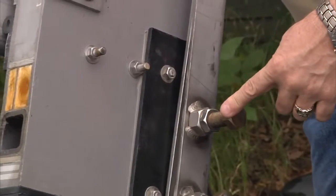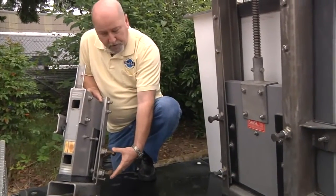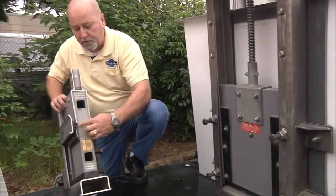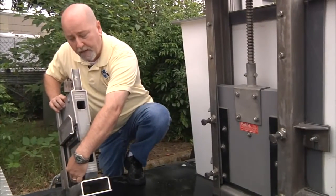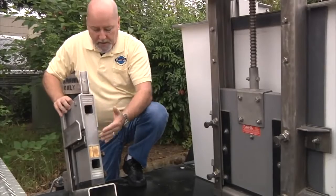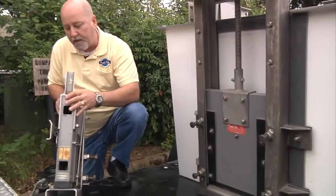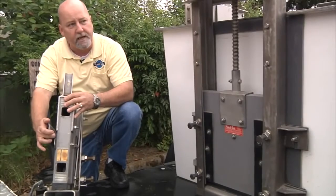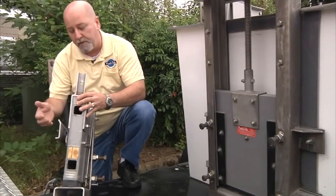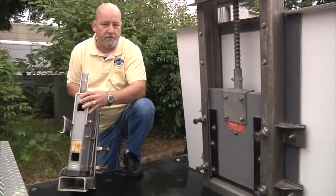On the opposite side, we incorporate a wedging design. The wedge itself has three-quarter inch bronze bolts, which actually pushes up against a UHMW wear strip on one side, which is pushing on the seals to push against the guide frame on the opposite side, to incorporate your seal. As this gate starts to lift up out of the guide frame, it actually frees itself from the seals and it almost becomes free-floating inside the guide frame. So now you have no more wear and tear as the seals are sliding up inside the guide frame. It's less wear and tear on the seals. You don't have to worry about them wearing out that often, and if you ever have to replace them, this will come completely out of the guide frame, lay it back on your shop table, and go ahead and replace the seals.